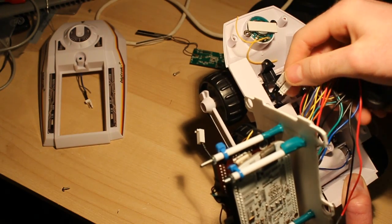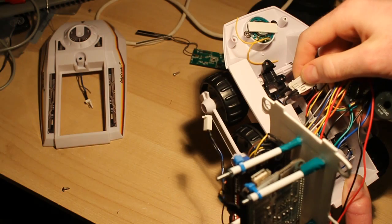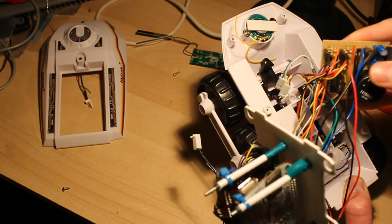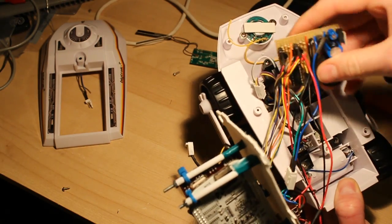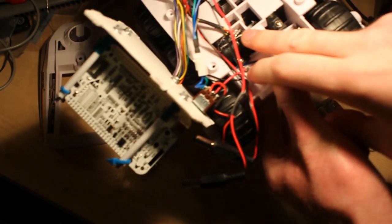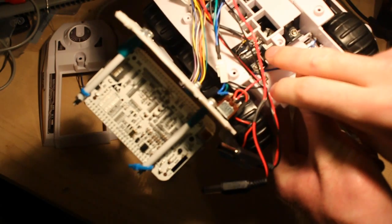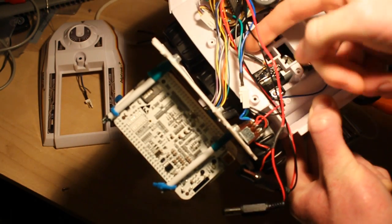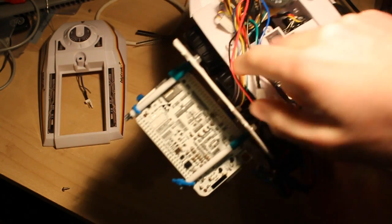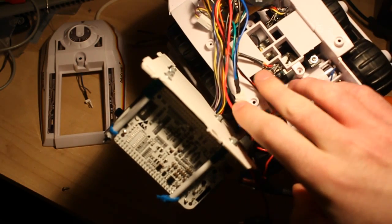I've put the motors on with these Molex connectors because obviously you don't want your code working and then plug your motor in backwards and have it going in circles. So you can see the opto encoders here look like a pair of LEDs basically, one either side. So the bundle of wires here, we've got red and black, which are power for the transmitter side, and then the yellow is the signal from the photodiode over here.